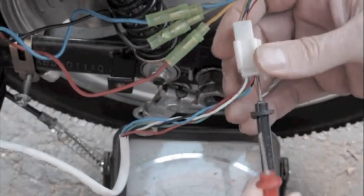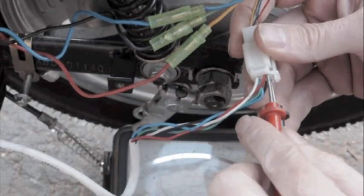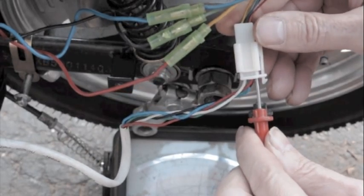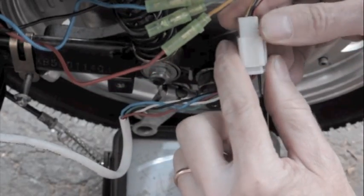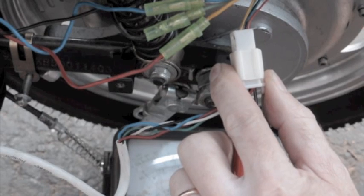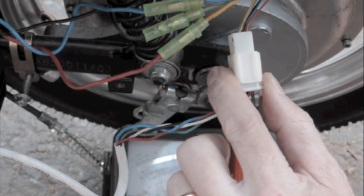Plug into the negative lead and check my voltage — so there I'm reading my voltage across the hall sensors. Now if I just go from one hall sensor to the next, I can measure it. I'm getting voltage for the blue one, and as I turn the motor I can see it turning off and turning on again.